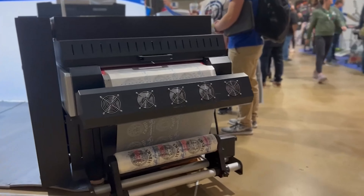Even with that reduced amount, there's no dye migration — that's a light white with no pink coming through on red poly. Keep all the fine detail. You can gang print these. There are companies out there that'll print your sticker labels for neck labeling, but you've got minimum quantities and lead times. I can gang print a number of these and apply them as needed when an order comes in. It's one more level of service for your print-on-demand customers — they can personalize with their own website, care instructions, size information, maybe a special message — all things to really elevate a business to the next level.